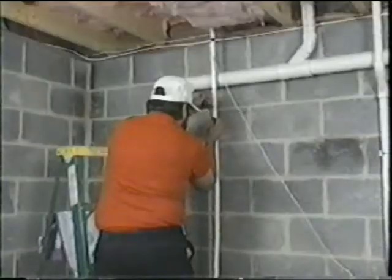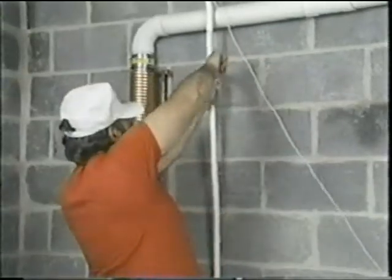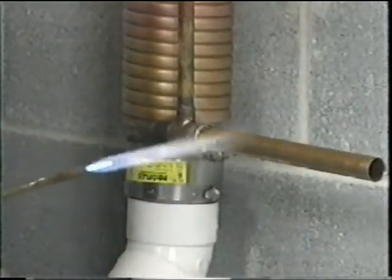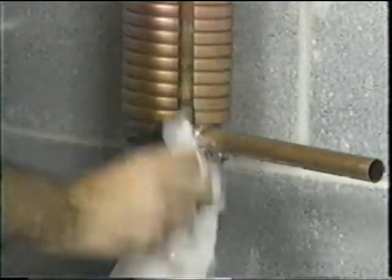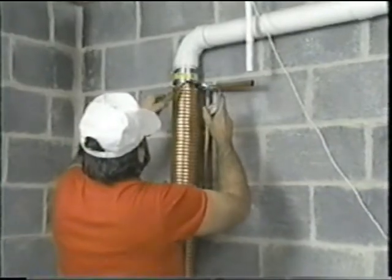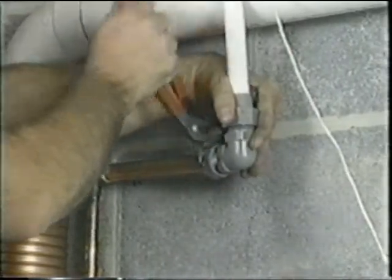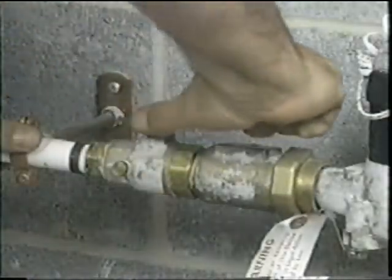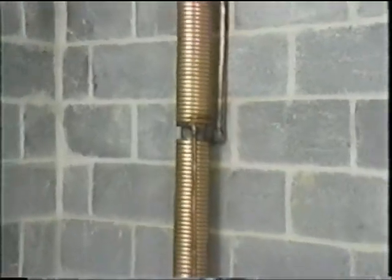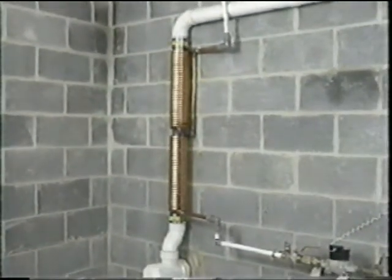Next, you will have to locate the water line and cut it before it enters the water heater. It will be necessary to drain all water before final assembly can be made. Connect the bottom GFX tubing end to the inlet water flowing from the shutoff valve, routing as necessary. Connect the top GFX tubing end to the main water pipe that supplies the house, using care that they are in the proper order. Finally, turn on the main water valve and check the system for leaks. Now you're ready to enjoy an endless hot shower with little fear of running out of hot water.